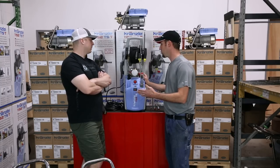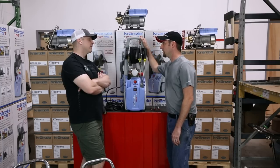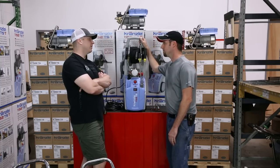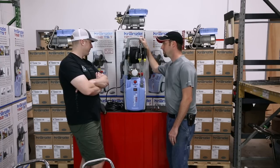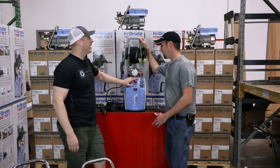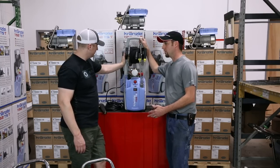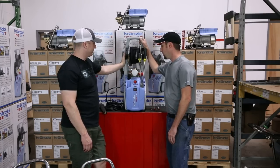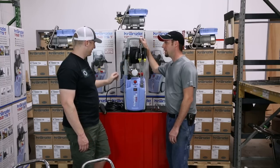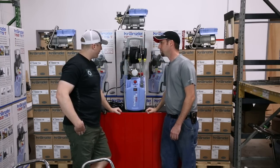It's not a constant-duty system — I wouldn't want to run it 12 hours a day every day, because the service life wouldn't live up to expectations. Even on a 12-millimeter pump the service life would be even shorter. But this is not designed to run all day every day either. For an occasional use — an hour a week or even a couple hours a week — this is overkill. For that kind of use it's a 25-year deal, and I've serviced them about that old.